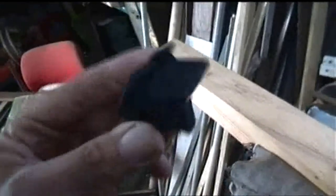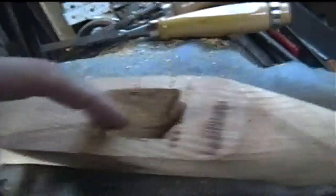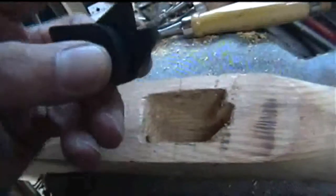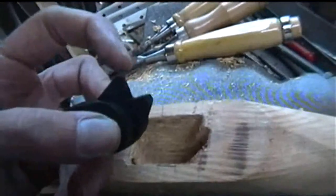Right, so there's the release component. I think it's looking fairly good. Now it's being oil blued. Now I've cut this recess out in the stock. As I showed earlier, that was the general shape I was going for, and I think that's mostly what I've achieved. Now it's got that extra recess in there, which is 10 millimeters wide, and that's for this part to roll over inside, which is where the trigger catches on it. So we could call this the sear if you wanted.